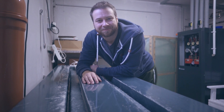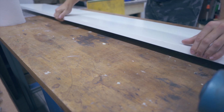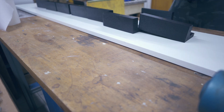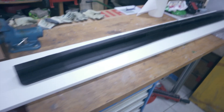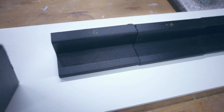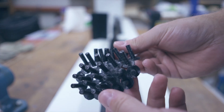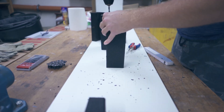Let me show you what I've done. I started by laying out all the parts I 3D printed. I use my Ender 3 V2 with regular PETG I buy off Amazon. One extension consists of 10 different individual parts. On each end I added a small recess so I can connect them via pins that I've also 3D printed. I drilled out all the holes because there was some support material left that had to be removed before I could insert the pins.